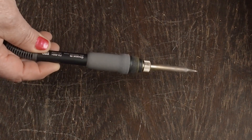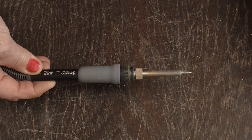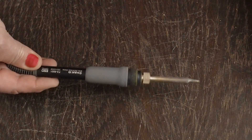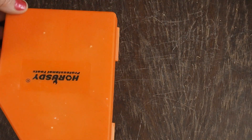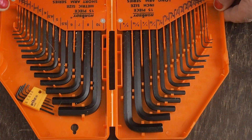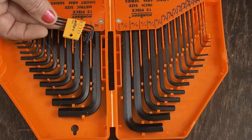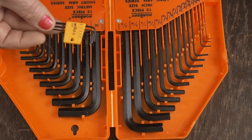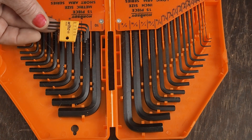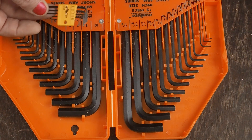You're going to need some sort of a soldering iron — you want one of these little pencil kinds, not one of those giant old welder types. Anything in the 20-watt range would probably work fine. This is a nicer temperature-controlled Hakko, but if this is going to be your only project, you can get by with a much cheaper little pencil iron — 15 or 20 bucks on Amazon. You're also going to need some Allen wrenches. I'd suggest in the smaller sizes getting a quality set. I think the only Allen bolts we're going to use are holding down the power resistors. You want quality Allen wrenches in these small sizes so they don't round out the inside of the bolt — nobody's happy when that happens.